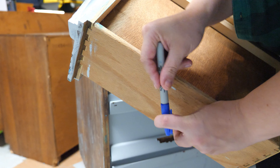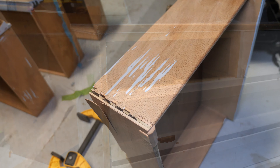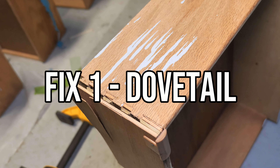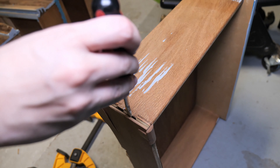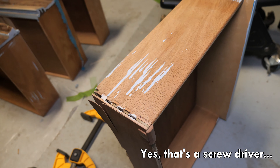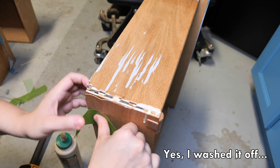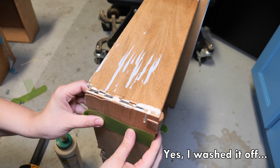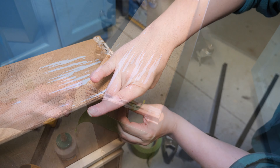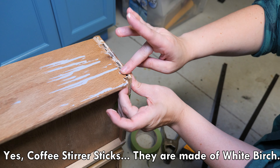When removing the drawers from pieces, I number the bottoms so that I can put them back in the correct place, and then I don't have to think about where the drawer goes. There are quite a lot of drawer repairs on this piece. This repair was damage done to the back dovetail joint on one of the drawers, and you can see that the plies started to separate. To fix this, I ended up gluing the pieces back together, then taped and clamped the drawer. Once this was done, there were some gaps in the dovetail plies where they had broken off over time, so I simply wedged some coffee stirrers into the gaps. Once everything dried, I sanded it smooth.